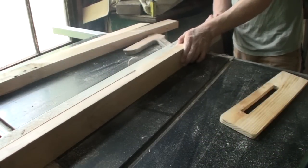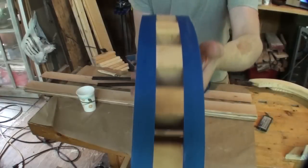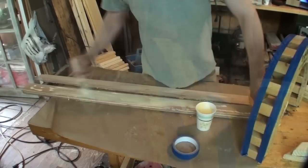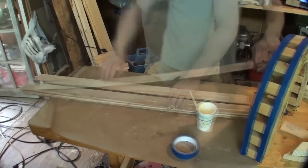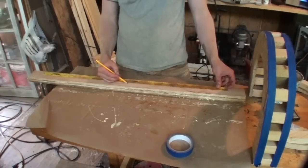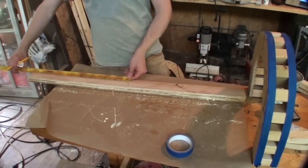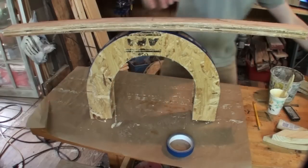Next up is ripping the strips — I ended up ripping them slightly under an eighth of an inch. Pine's a little stiff so it can crack. On the form I put some painter's tape; you can use transparent tape also, just to keep you from gluing the strips down. Then you want to put glue all over your strips — put it on both sides to make sure you get good adhesion — and then mark the center and clamp that to the center of your form if you're doing an arc shape. Otherwise, you can just have it marked to any sort of reference point.